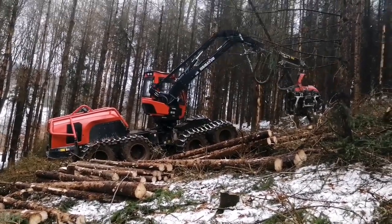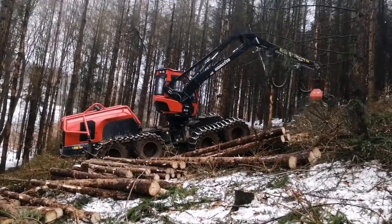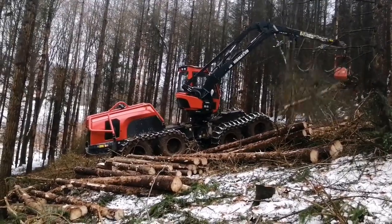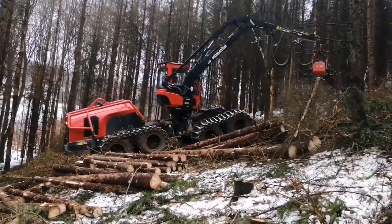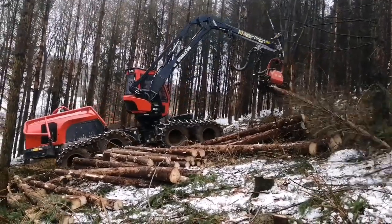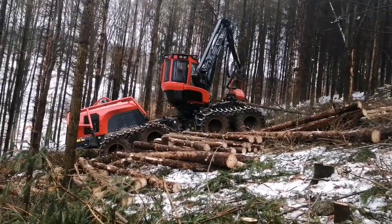The Komatsu 931X is a powerhouse offering considerable stability and low ground pressure. With 8 wheels, operator comfort is high, ground damage is reduced, and maneuverability is excellent in steep terrain. An impressive 200 kN of underlying tractive force and unique interaction between engine, control system, and power transmission.